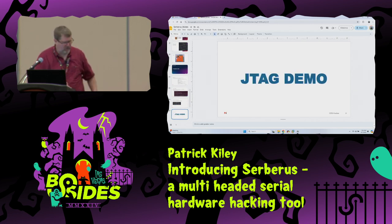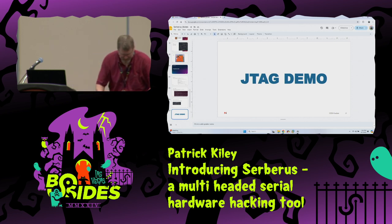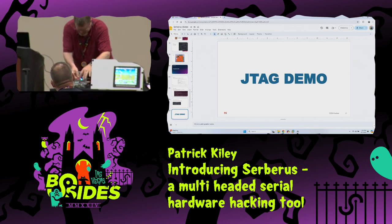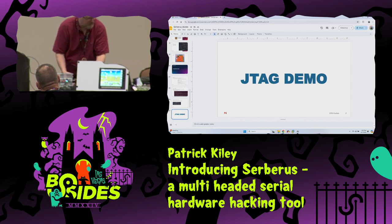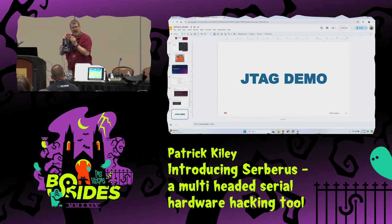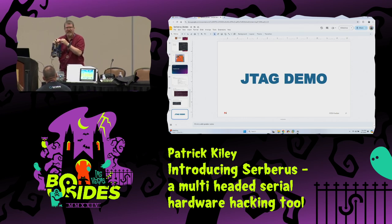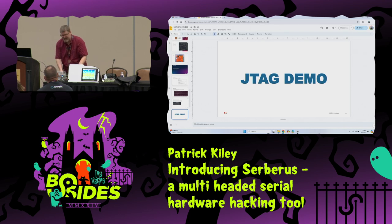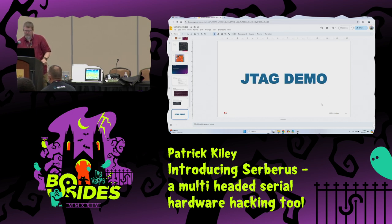And now for the JTAG demo. So what I have here is an automotive target. I'm going to try and connect it, make sure it's in the JTAG mode. So there's a switch up here next to the level shifter selection that switches it between serial wire debug and JTAG mode. It uses the same sets of pins, but where you need the pull downs and pull ups and everything else is a little bit different, but to move it between those two modes, it's a single switch connection. This is going to be JTAG though.